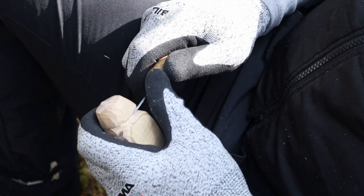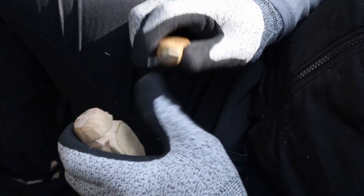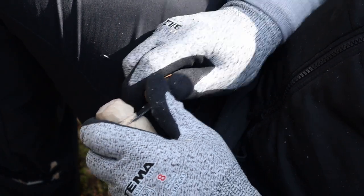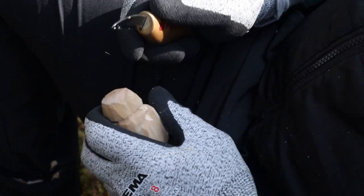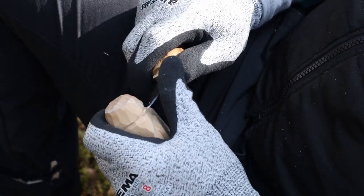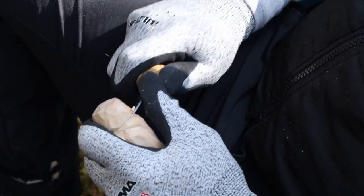Right here in the back, it's up to you, but it might be hard to do a really straight cut because of the size of your blade, so you could cheat and do a little V-cut instead. It's in the back, nobody looks at that. You don't really want to force the blade against the wood. When you have the cut going all around, don't be afraid to go deeper. That'll create more shadows.